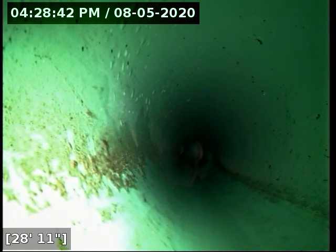It's not so much the standing water issue, it's the fact that it looks like someone damaged it with a vehicle. I'm concerned for the longevity of the sewer line at this point. The standing water is on the more minimal end, but that does concern me that the pipe's been stressed. I've seen a lot of times where people have driven over them and it stress fractures or damages the joints. At this point, they look like they're intact.